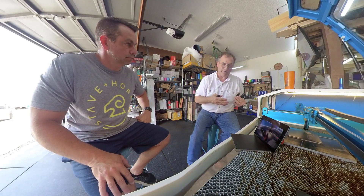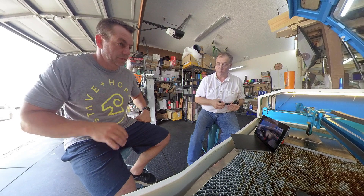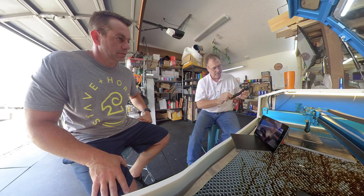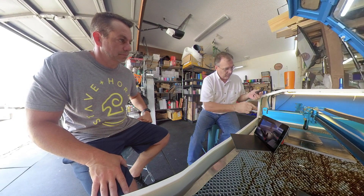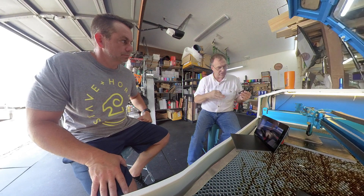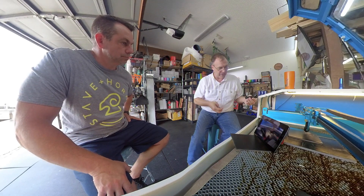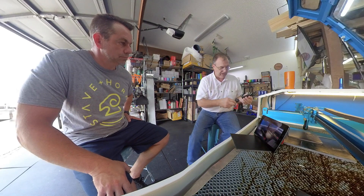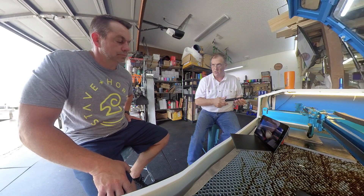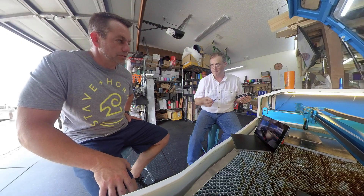They're extremely easy to clean. If you get into a habit of cleaning your lens every day before you start, you're more likely to do it if it's easy to clean, easy to put back in, and easy to set. When I design the lens with the nozzle, accounting for all the stacking tolerances of radii, the focal point is going to fall within a range of about 4 thousandths — 0.1 millimeters. Adding the stacking tolerances of how it sits in the holder and the nozzle, I'm looking at around 6 thousandths variance.